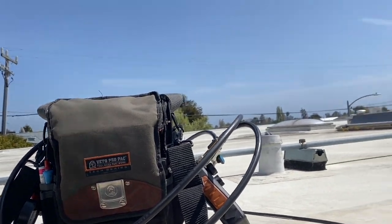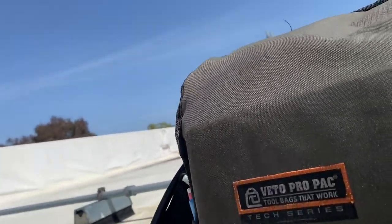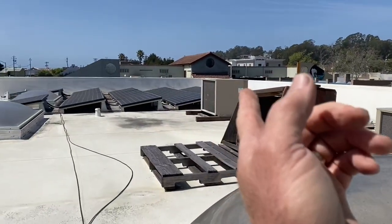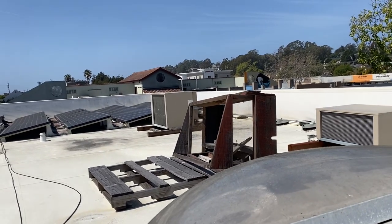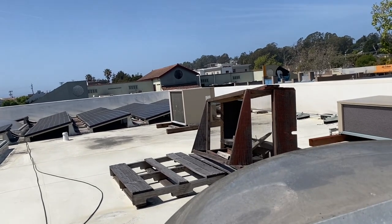All right, YouTubes. I'm back where I did the compressor change out at the nighttime service call, and I'm doing all my follow-ups and my checks. And just from looking at the old compressor and the way the new one, here's what it looks like in the daytime, the way the new one was running, I'm pretty much convinced myself that that thing flooded back and took out that old compressor.